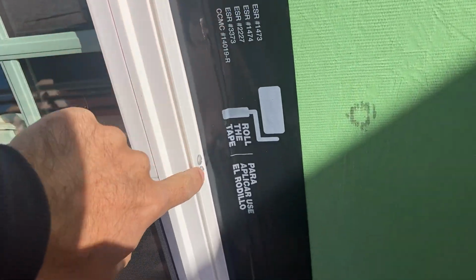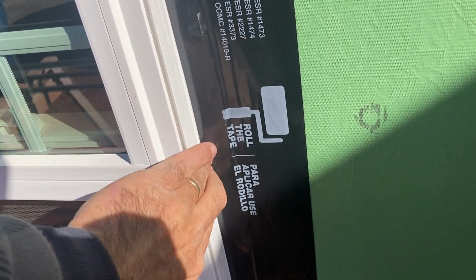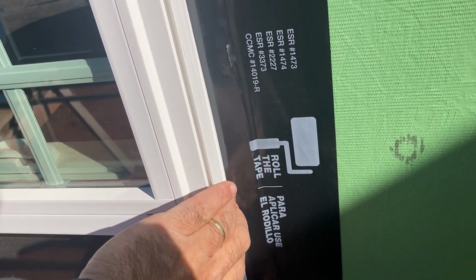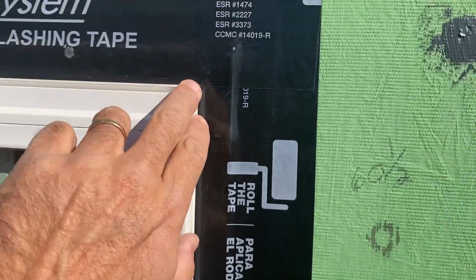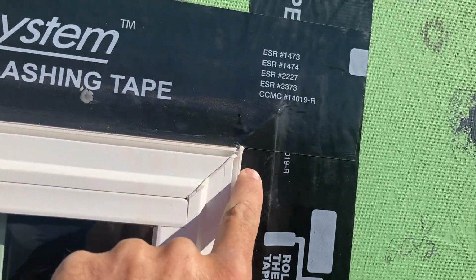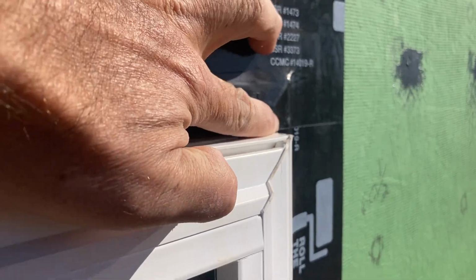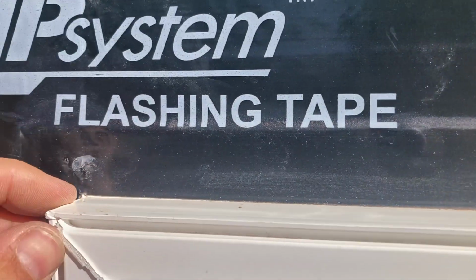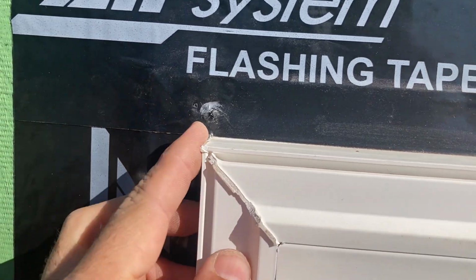These windows also have some screws, so that becomes a point where your J pushes out on it and leaves a little bit of a gap there, but I'll show you how I minimize that. Let's get these corners trimmed first and I'll show you the after look. The sharper the knife, the better. Just get your corners trimmed down just like that, and that'll allow you to get that J channel nice and tight around the corner.